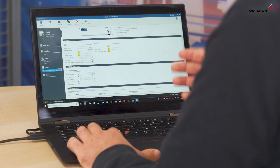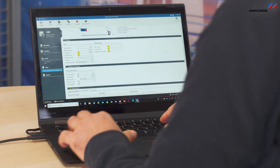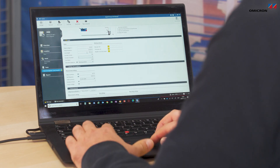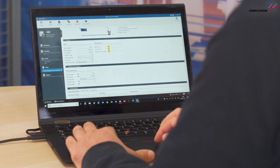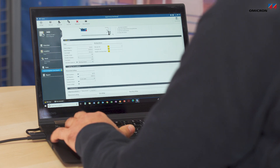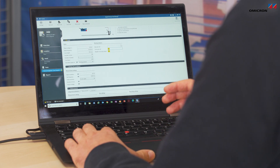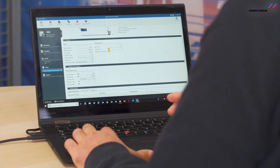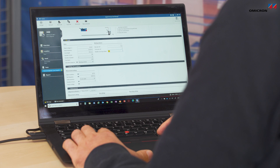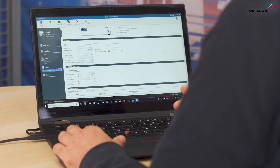This asset has a core length of 500 millimeters — it's a rather small hydro generator — and it has 156 slots. We would like to calculate our excitation voltage based on the winding scheme; calculation based on dimensions is possible but the winding scheme is recommended. In this stator we have two bars per slot, an upper bar and a lower bar, with a coil winding, meaning two turns per coil. In this particular case we have only one parallel circuit per phase.